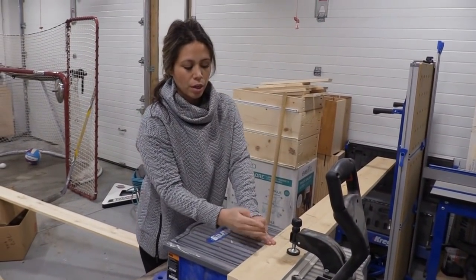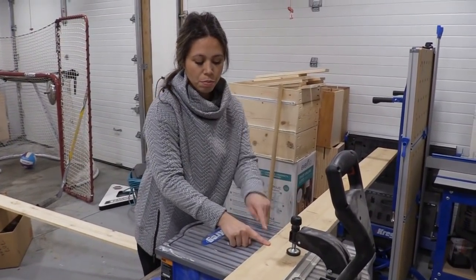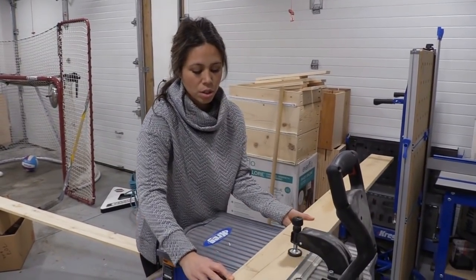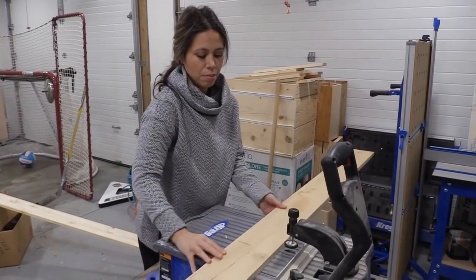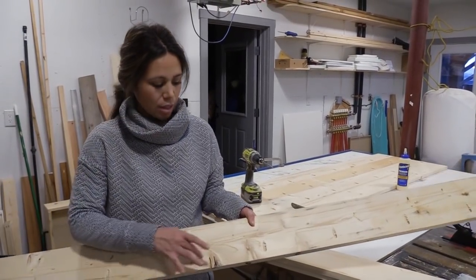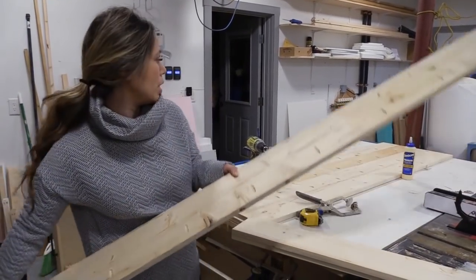I know where I'm at every 8 inches because the deck here ends at 7 inches. So if I just pinpoint kind of the spot that I just drilled the last hole and then bring that past a little, I know I'm about 8 inches. Once I get all the pocket holes drilled, it'll look like this. It's a pocket hole about every 8 inches. You don't have to be exact, but just about that far is about what it needs.